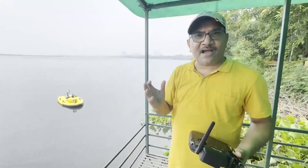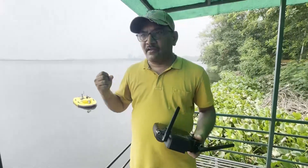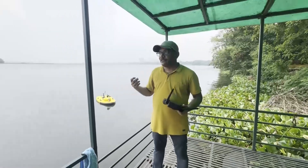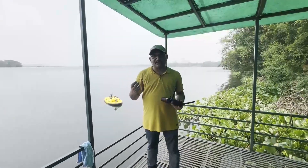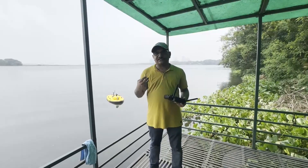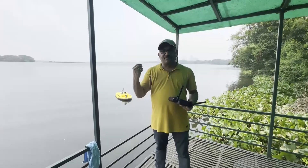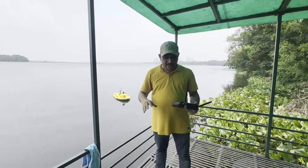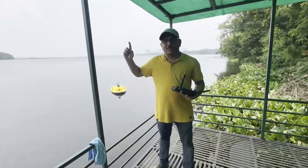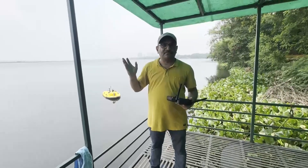It's a complete package — the surf boat with RTK GPS, antenna, and the complete iOS interface and ADCP. It's very easy to measure discharge in the river, whether you're using the ADCP for discharge measurement or bathymetry applications. For bathymetry, you just draw the line plan, feed it into the instrument, and the boat will automatically go and collect the data. It's so easy to use ADCP now.